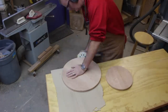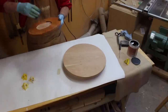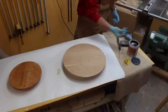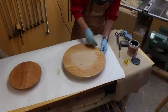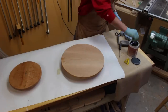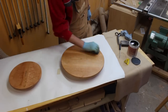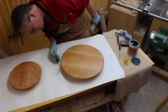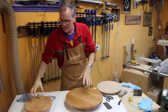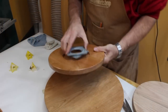These are going on a kitchen table so they're going to get wet sooner or later, so I want a nice polyurethane coating. But first I'm wiping on a little bit of shellac, which gives a nice head start on the color — polyurethane is very clear, and shellac is called the universal sealer so it can go underneath anything. After the shellac I wiped and brushed on several coats of polyurethane and we're almost done.